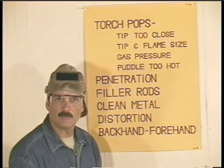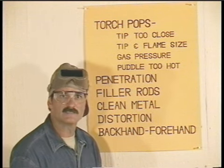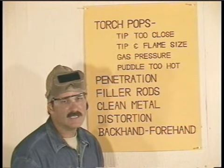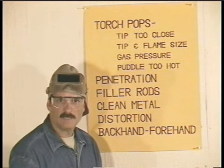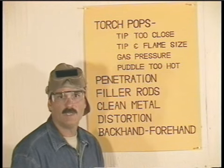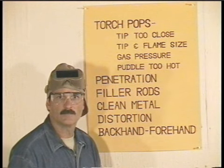Also, when the metal cools and contracts, there'll be a lot of residual stress along the sides of the weld. That's why the metal will break before the weld breaks. There isn't a simple solution to this warpage and stress. Let the metal cool slowly. Don't dip it in water or anything. And realistically, this won't be a big problem for the projects you'll be using oxyacetylene welding to do.